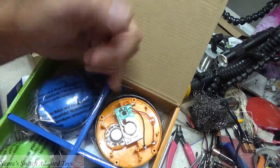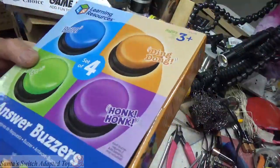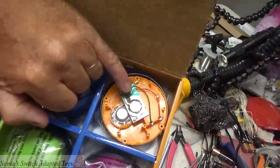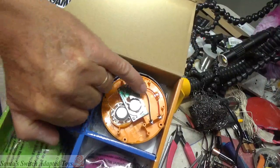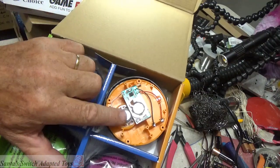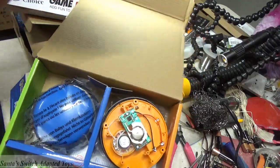A couple of contact points, you clear some stuff off. It's doable. It's not the easiest or the best, but it's doable. The reason I say it's not the best is because you're soldering to the circuit board in a couple of places, but if you do it correctly, you can make a reliable button. I don't particularly care for these dome buttons, dome switches.